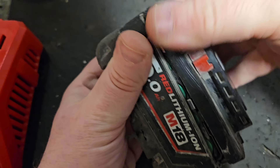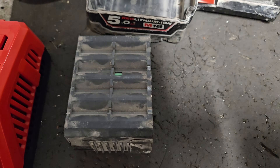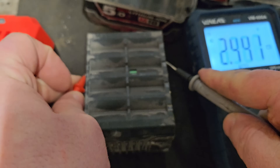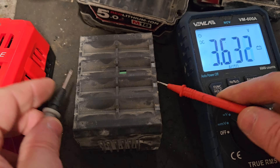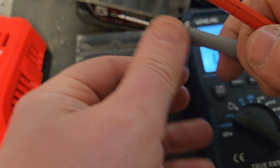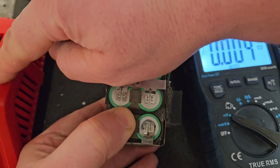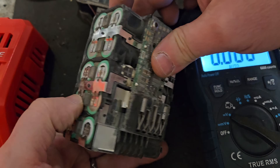The screws are already out so I'll just take it out of the box and get down to business. We've got cell imbalance across the pack. Going all the way down, number one is 3.57, number two is 3.59 — very close, close enough. Number three is 3.63, a wee bit higher. Number four — that's the problem. That's why she's only charging to three bars, because this one is 3.85. This bank of cells has achieved a full charge, that's why the charger stopped. The others have not yet got that far. So what we need to do is rebalance that pack.